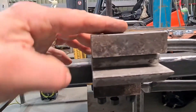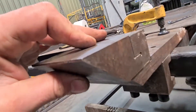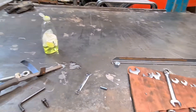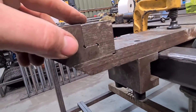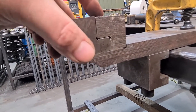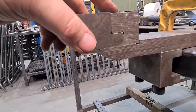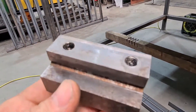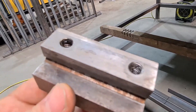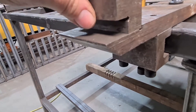So when that clamps on there, that gap between there and there should be almost interference. So that when the finger goes in there like that — sorry, got a little interrupted, neighbors coming in for a chat. What I was saying is that you can see that is a fairly snug fit, to say the least. So if there's any marks or rust on the surfaces, that clamping force is just not going to take place and the finger won't be held tight. It's the fact that they've been trying to bend bigger stuff — too big for it. And what that is doing is not giving us the clamping force to hold that toe. And a loose toe is just, well, there's just no point. It's ridiculous.